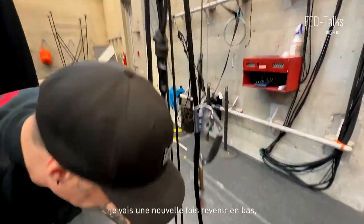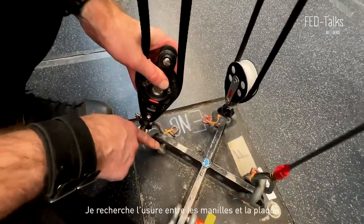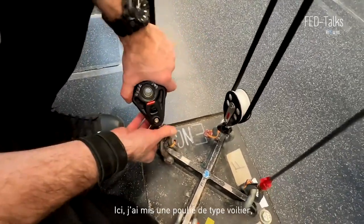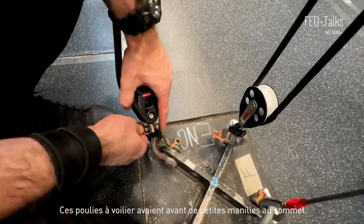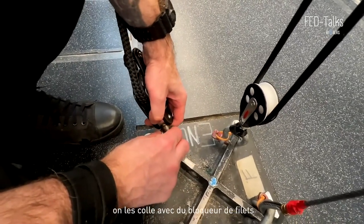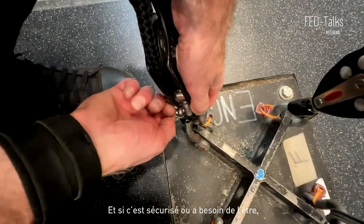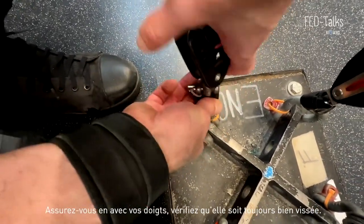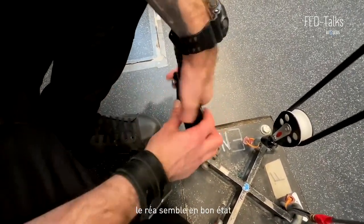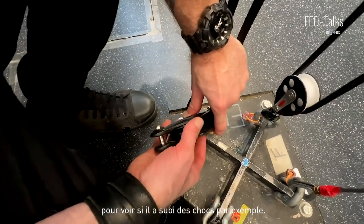Still going back to the bottom, I still have a shackle. Look for the wear between the shackle and the plate. Make sure the shackle is very well screwed in, if it's moused or needs to be moused. Here I've got a sailing type of pulley. On these sailing type of pulleys, you still have small shackles at the top. Here at the school, we glued them with threadlocker — a blue threadlocker put in the shackle pin. Make sure it's moused, and with your finger confirm it still screws in. My pulley swivel head still swivels good. My rivets here are in good condition. The sheave seems to be in good condition — I'm making sure it turns, and looking at it to see if it's been banged around.